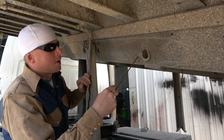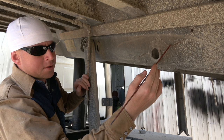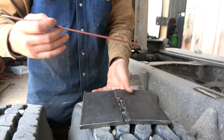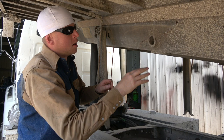What needs to be done to properly repair this is all this material has to be completely removed, and then an open V butt weld needs to be installed. That's where we take the plate steel and gouge it out — and depending on the thickness of the metal, it may take multiple passes to fill it up properly and flush. With this particular instance, we'll probably end up putting another plate on top and welding around that plate also, because this has been so fatigued from improper craftsmanship.